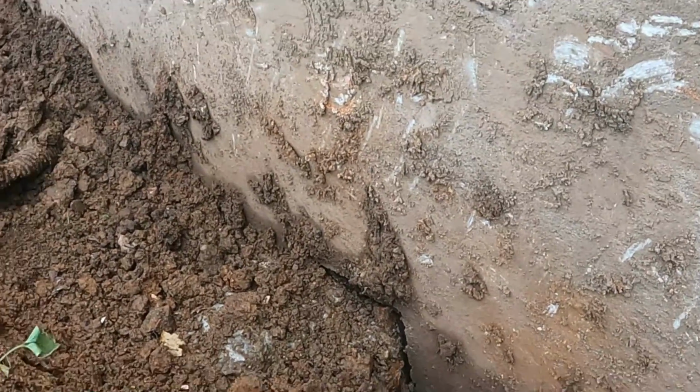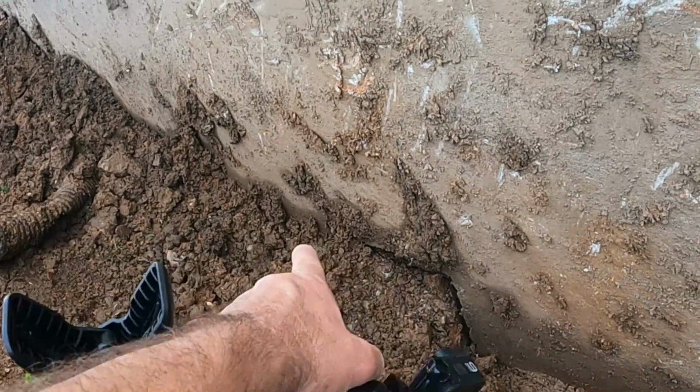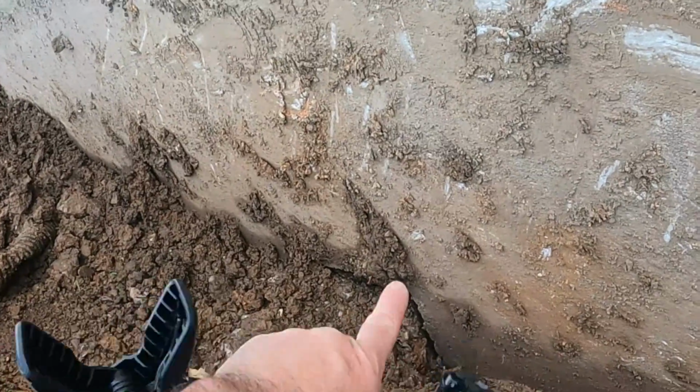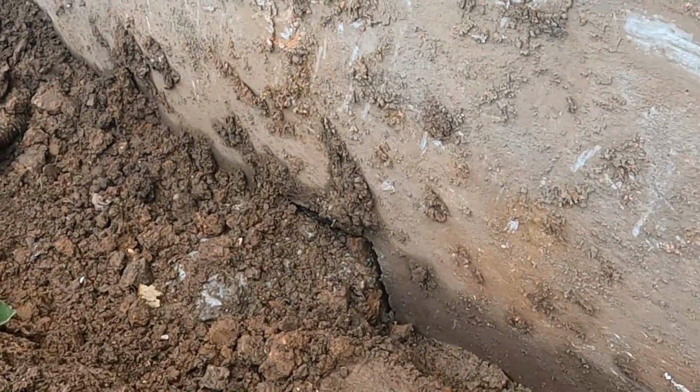And I'm going to start it right here. I'm going to put concrete in that hole. I've got some bagged concrete. I'm going to clean that up and put it around that and poke back in there, and I'm going to dry set it and it'll draw moisture from the ground here and do its own thing.